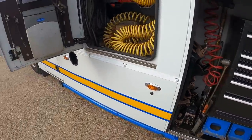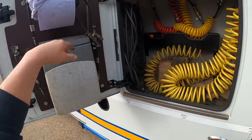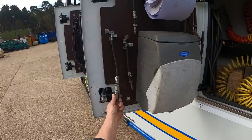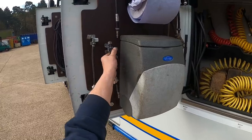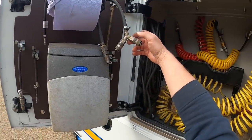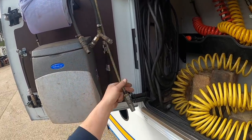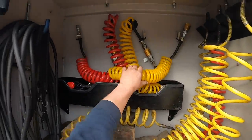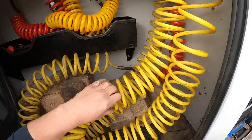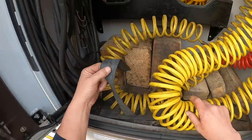Next locker - this is a heated hand wash station. I've got some soap and blue roll in there just to clean your hands up and get any oil off. These are different test points that we can fit on air dryers or air tanks. I made a few up myself. I normally use this one on a Mercedes - you can blow one into the air suspension and one for the brakes. These are smaller susie leads, palm couplings for European trucks we pick up, some longer susie leads, blocks of wood, bungees, and an extra airline.